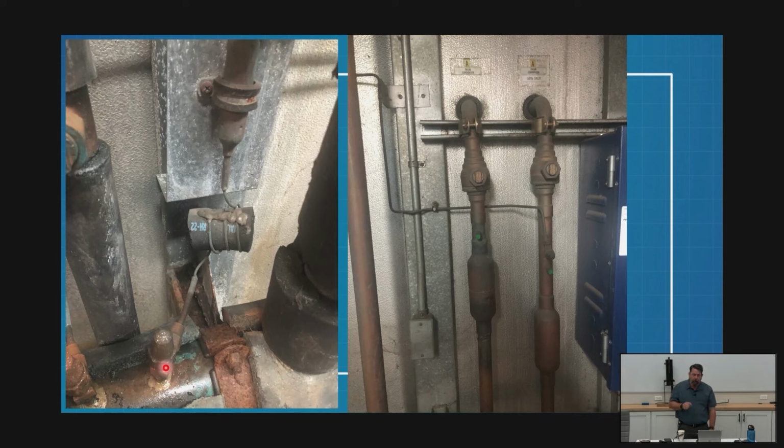So if I walk into a store that's in 50% split, has been in 50% split, and I screw my gauge onto the half that's closed, that we're not using, what pressure should I see? Come on, Yankee. Any of you Southern boys know? Wait, what was the question? If we walk into a rack that is in 50% split, has been for a little while, and I screw my gauge onto the half that's not functional, not working. Technically zero.